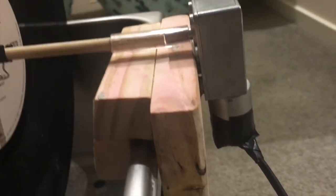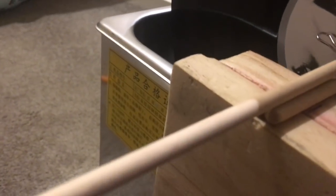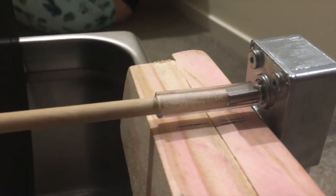We've managed to glue the motor to the piece of wood and measure the exact height to make sure it's completely even and sits on the dowel perfectly so it doesn't slip off when it rotates. The weight of the records means the dowel will stay exactly where it is. We've now got two records on here and they're rotating perfectly — slowly, but you can see it working. The rod connects to the motor just with a bit of tubing.